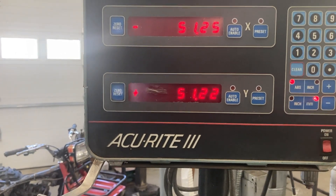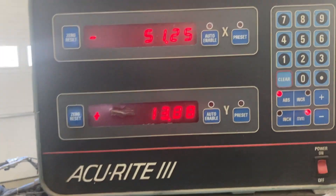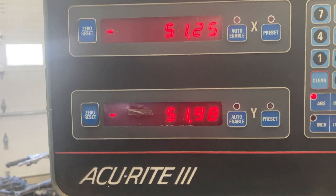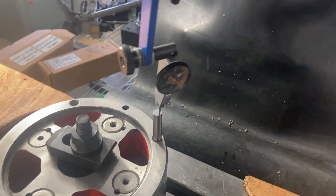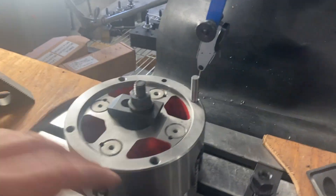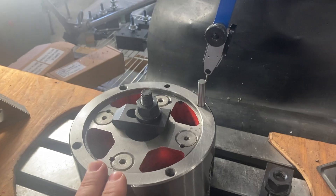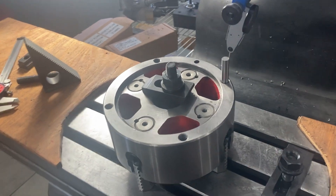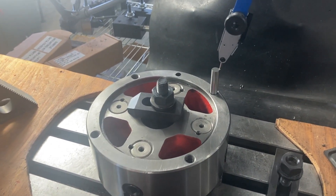Let me raise the quill and go over to negative fifty-one and a quarter on the Y. You can see we've moved over the pin and, without fine dialing it in, we're basically right over that hole. You could spend more time to super fine-tune everything, but this is a basic way to figure out bolt circles without using any math. I hope this shop tip was helpful — let me know in the comments other ways you might set something like this up in an easy, quick way without using math.